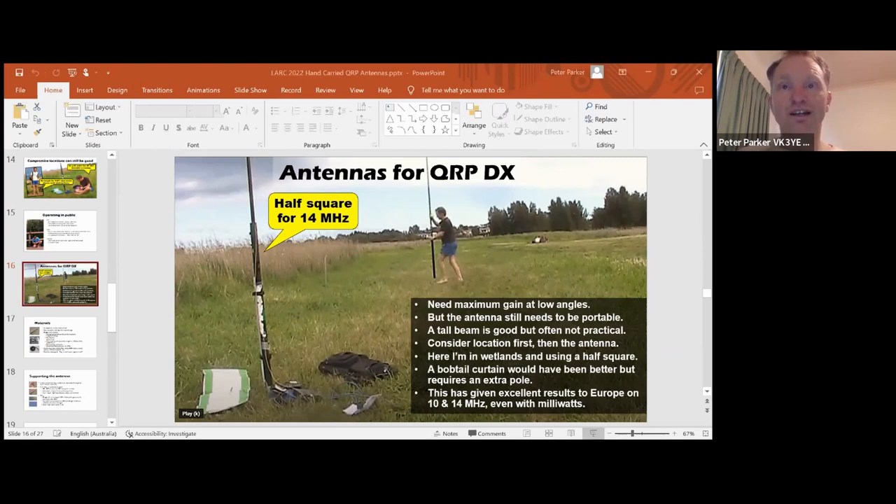Vertical or sloping Yagis might be okay for 21 or 28 MHz, but you'll need a tall and often heavy pole for 14 MHz. Even a horizontal dipole at 30 or more feet high is not always easy to obtain when there's no tall trees. So the options diminish if you're thinking about a good low angle antenna for a band like 20 meters. The bobtail curtain is probably one of the best on a performance-to-simplicity basis, although it does need at least two poles, maybe three, as it's three verticals separated by half wavelength each with wires going across the top.